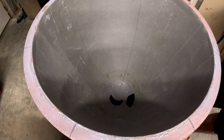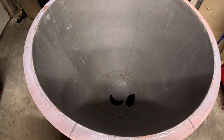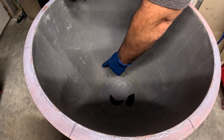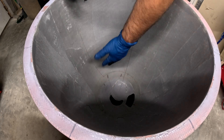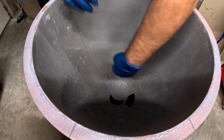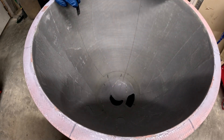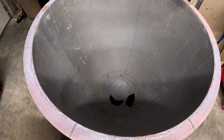I've got four layers of 1k carbon — actually a 1k/3k hybrid, with 3k running the length of the roll and 1k in the width. I'm going to do one layer with the 3k running the length of the door, then another layer on the bias so the 3k and 1k are both at 45 degrees. The next layer will also be on the bias but flipped so the 3k and 1k create an X pattern, which gives torsional rigidity. Then there'll be one final layer with the 3k yarns running the length, and it will all be covered with peel ply.